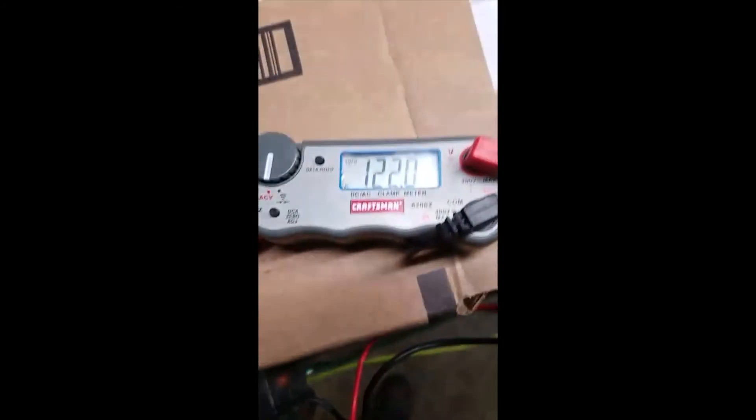So I think this ran with the snowblower and burned itself out — it's junk. You'd have to get a whole new assembly like this; the starter and switch are all one piece. Look, I'm not even touching the button and I've got 120 volts, and it stinks — burned out. So I'm quite certain that's what happened to it. That's crazy.